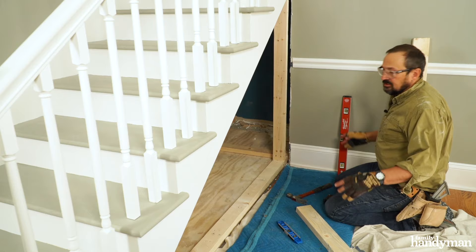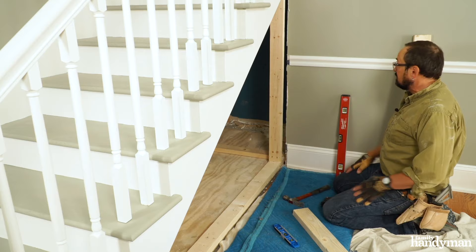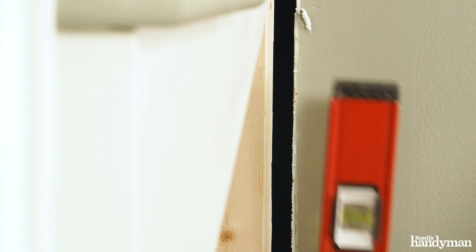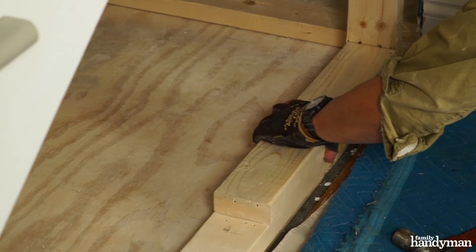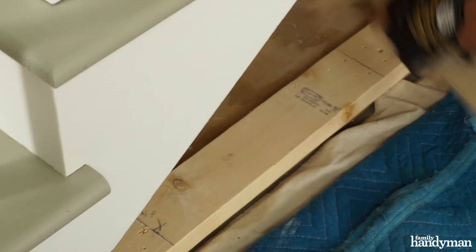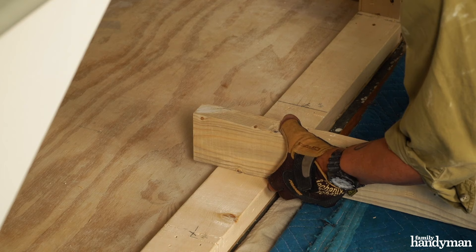Got the studs cleaned up and the next thing to do is divide the opening into three equal sections for our drawer boxes. I'm going to use these existing studs because they are in a good spot. You definitely want to make sure that your wall is plumb so that your doors close the way you want them. To make layout easy, once you've done your math for your openings, just cut a stud to the width of your opening, put it up to your existing stud — this way you'll know that things are just where you want them — make your marks, and then you can use the width of the stud to mark your other edge.